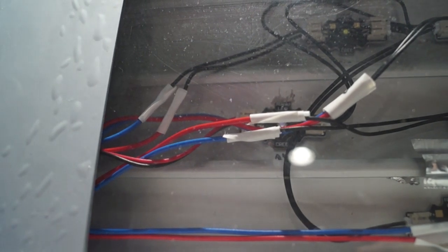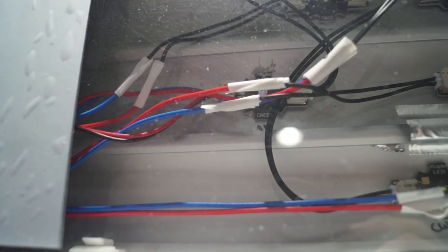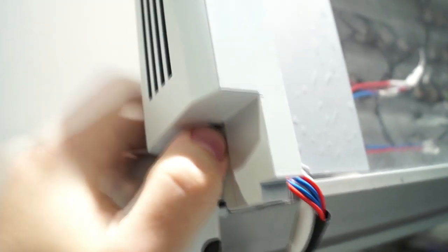Red and blue cables were the easiest things to find at Jaycar, just so I know if it's a plus or minus on the LED — obviously if you get those wrong the things don't turn on. I managed to keep the switch, which was originally in the Red Sea Max anyway, and I wired the Rapid LED controller to this so when I lift the hood up for maintenance I don't get blinded. You can see it's pretty bright — I'll turn it back on and show you the color layout.